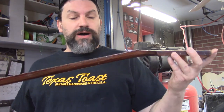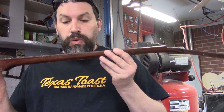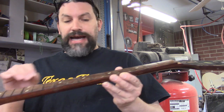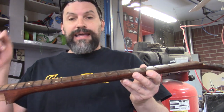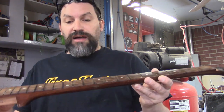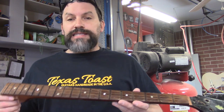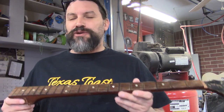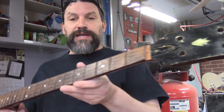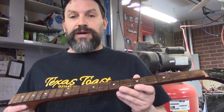Let's call that a video. A couple of things to point out: don't go poking at the little chips and flicking them out. Blow off all the ones that aren't in place, but before you go taking chunks out that you can't put back, flow some super glue in here — you're going to sand it back anyway and re-level this board. Do that before any of that material goes away and you have to backfill with filler, because no one wants filler on the neck. If you have any questions about what we did or the tools we used, please leave them in the comments below. If you like the video give us a thumbs up, hit subscribe, and consider checking out our Patreon — even a buck a month helps. We are entirely viewer supported and that's the way we aim to keep it. Until next time, this is Matt at Texas Toast reminding you: if you're so smart, build it yourself.